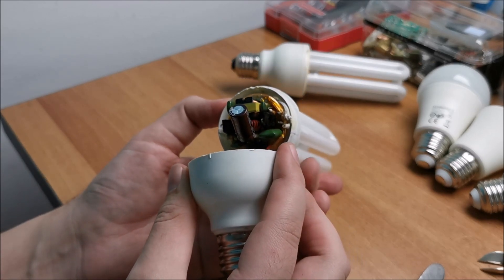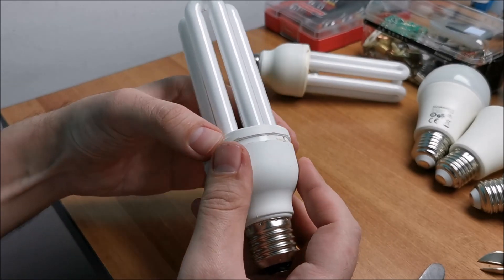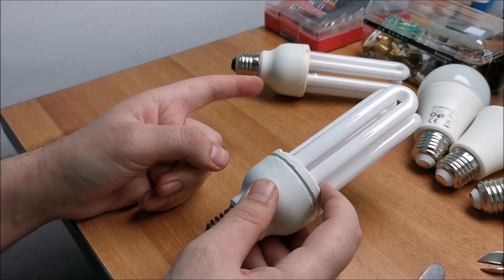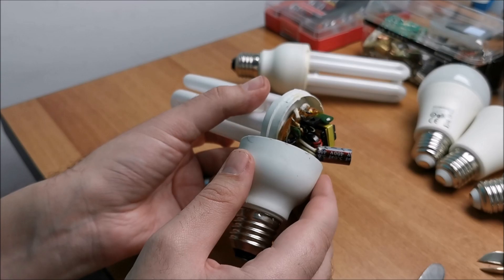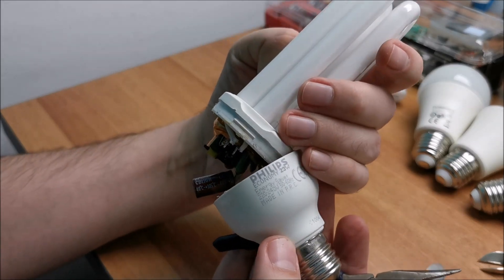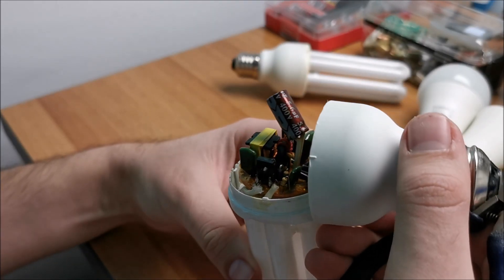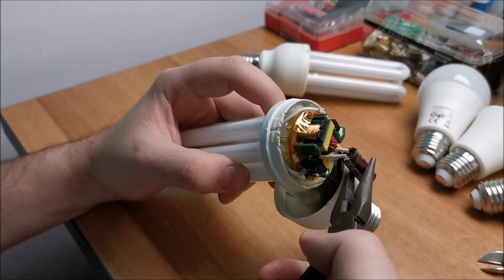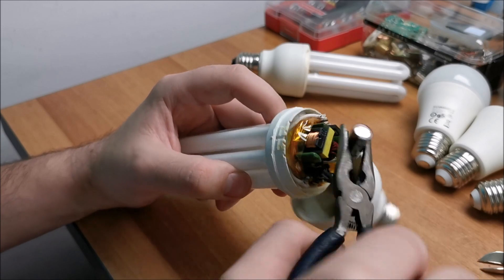You can see here the smaller PCB that wasn't quite apt to the job — it tried to light up this thing but it never could. And I just realized I didn't show you how these things behave. Actually, these things are unplugged for more than a year. I'm sorry not showing you how they behave because I'd rather stay alive and not electrocute myself. Is this some kind of high voltage? 6.5 microfarads at 400 volts — so this can potentially kill you if you insist. I'm just going to wiggle it off until I break its leads, because this board is useless to me — it's not able to power this bulb itself. So I don't care what happens to it anymore.